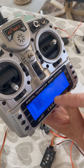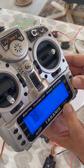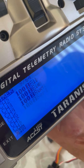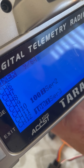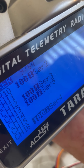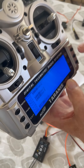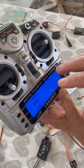This is the important one. I've left all those there although I can change them. You'll see that channel 5 is now servo 1. Scrolling down, you'll see that channel 10 is servo 2, channel 12 is 3, channel 13 is 5, and channel 16 is 4. That's how the Taranis is going to see them through the mixer. The inputs do nothing — it's the mixer that does it all.